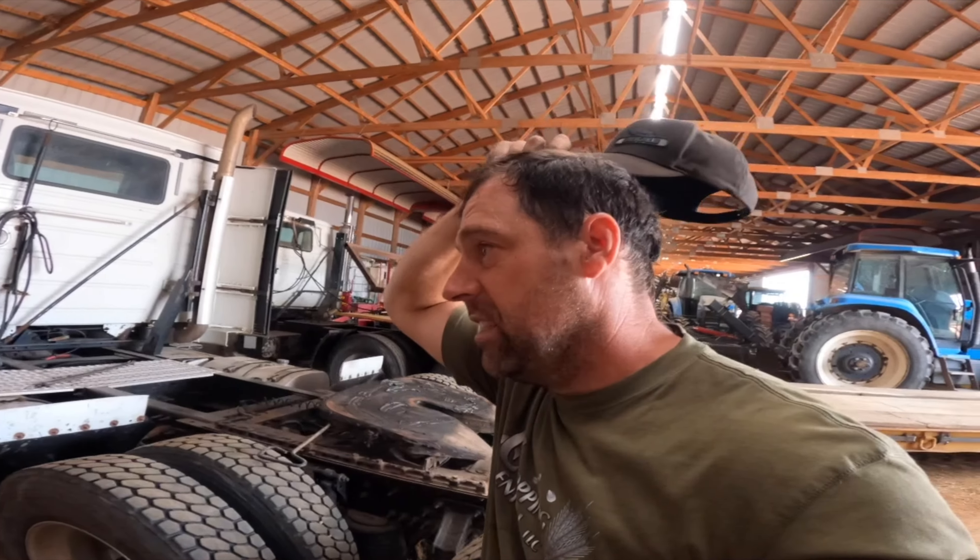Machine is on at about 1,500 RPM. Rotors are in neutral — I had them in neutral last year. Let's check if that tick is still there. It's gone. So that was definitely the problem. I really took a chance on that — I was hoping that was the problem. Common sense kind of said that as that belt goes around and hits that idler, the idler would just jump ever so slightly and go tick, tick, tick.